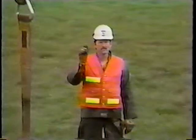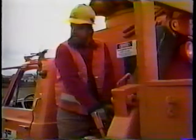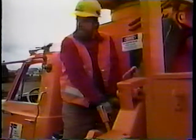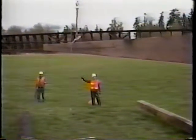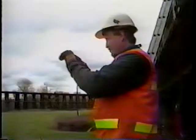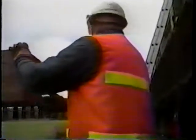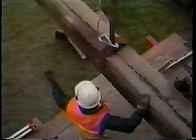Working together as a single unit, the 22 bridge crew begins to hoist the 42-foot, 12-inch false cap into place. Communications between the crane operator, the supervisor, and those on the staging platform are fluid and begin moving the false cap into its tight quarters. Prior to hoisting the beam, rollers were placed on the pile clamps to aid in sliding the beam into place. In the past, moving a beam this size could have proven to be quite a wrestling match. But with the use of the pile clamps and rollers, the false caps can be slid into place with little or no problem.